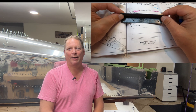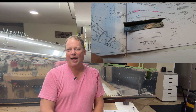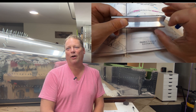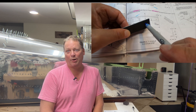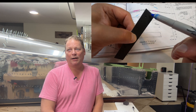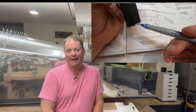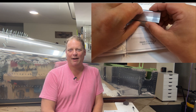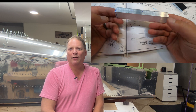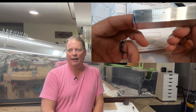Thankfully, I took the time when I was building this the first time and built some 3D printed templates for all the brackets that we had to fabricate. I put it in CAD and designed up all the lengths, where the holes go, and got all the angles right, then 3D printed a little template. I just mark it on here, cut it and drill it — I found it a really big time saver the first time, and even more so the second time I have to rebuild these. I'll throw up a video of how that worked when I can.